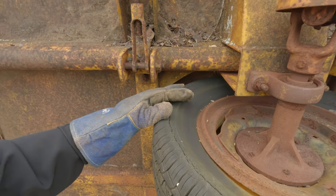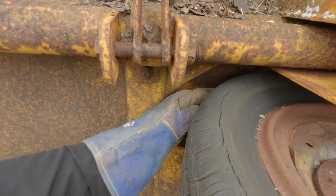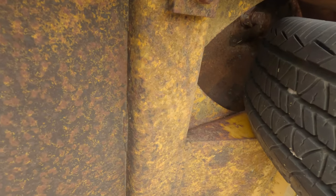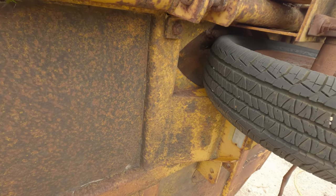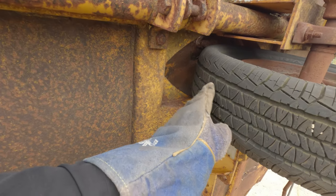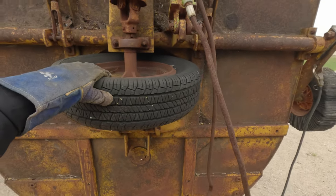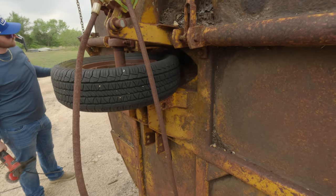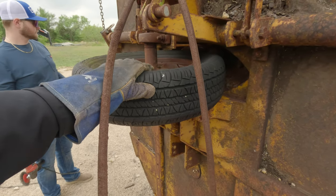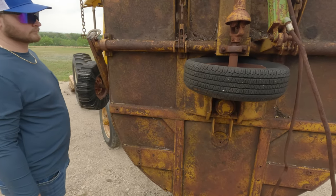While this is in the air let me show you this a little bit better. This tire right here runs a plate underneath here inside — that tire runs on top of that plate and spins the blades. If we hit something then the blade will stop and sometimes I've had to smoke the tires before. This is just a safe way of cutting fields that may have a lot of stumps. It's better than a gearbox because with a gearbox you're more likely to strip it or break a gear — this just slips. We could bust blades but it's still a pretty cool design. I don't know if they even make this type anymore.